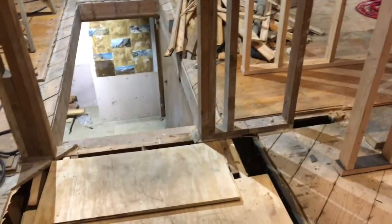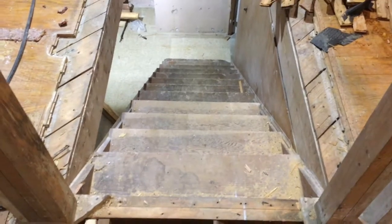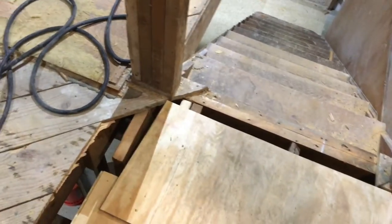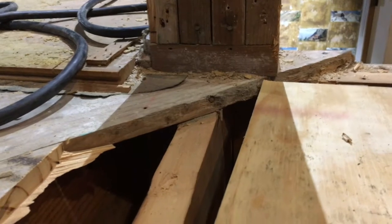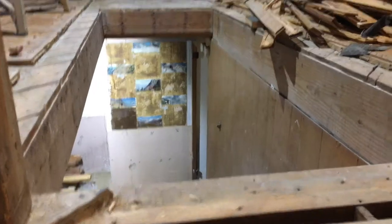And then this floor I'm waiting to replace until I know what we are doing with this wall, what goes here. And then also, depending on where these stairs go, these are gonna get moved. So this is ultimately gonna come out, and I wanna replace this floor when there's nothing on it, so I don't need to wedge 3/4 wood underneath that bottom plate. Or I could just kinda jig and cut around it, but like I said, I don't know what we're doing over there just yet. So. Yep.